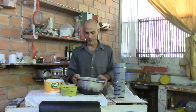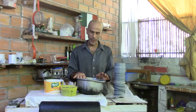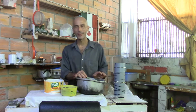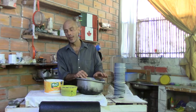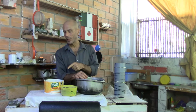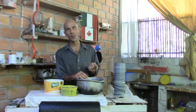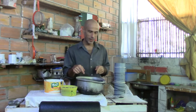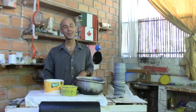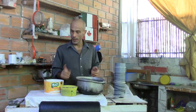Here I have some rocks that I have been soaking in water for about 2 hours. I think it's important that the rocks get some time in the water, because otherwise they could suck too much water out of the fresh cement too quickly, which would make the new concrete weaker. So they've been in here. I am hoping that because of these rocks I will need less cement, because at the moment I don't have a lot of cement.